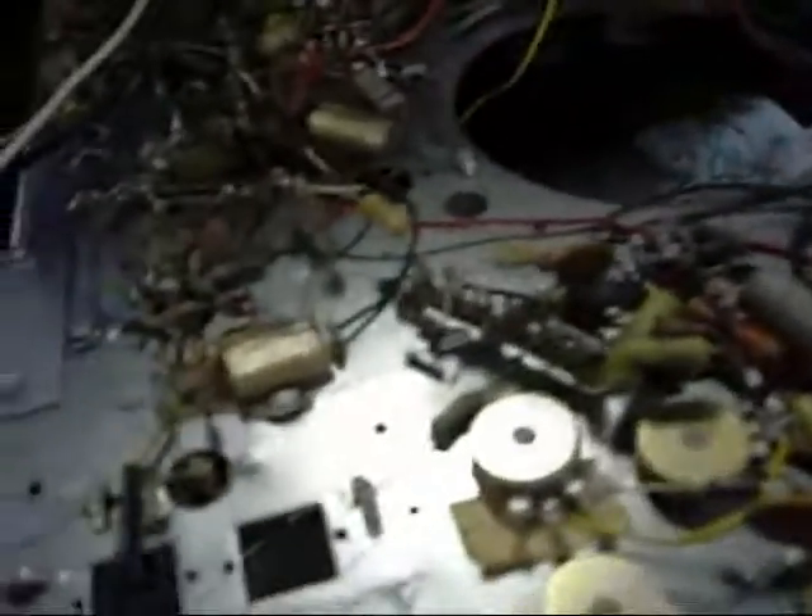I'm just in the process of cleaning the whole thing up, it's come up pretty good. There's no obvious damage on the control board — no printed circuit. Mice have been in here but they haven't chewed anything too bad. Obviously it still works, it just needs recalibrating because all these horizontal and vertical hold pots have been knocked around. One thing I notice is this lead floats in and out of the doubler or whatever that is — that might be our source of arcing. I'll look into that one.